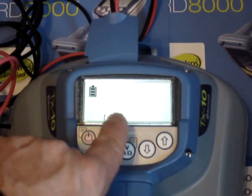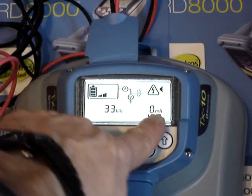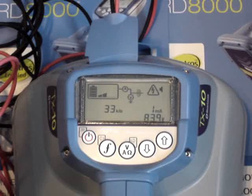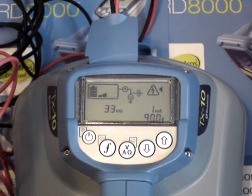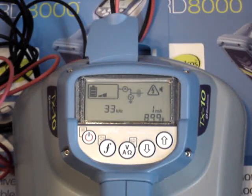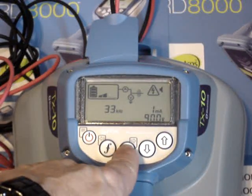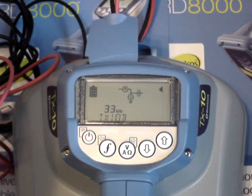Push the right arrow to go into that option and toggle it from low to high, then back out of the menu system by hitting the left arrow. You'll see a lightning bolt show up on the screen — it moves up to 30 volts, then switches and goes up to 90, eventually maxing out at 90 volts. Even though I'm not hooked on to anything, now I have one milliamp worth of current going down that line — it's actually completing a circuit by jumping the air gap between the two alligator clips because we threw out more voltage. This is unique with the radio detection unit. If you turn the unit off and turn it back on, it will always reset back to 30 volts as a safety precaution so nobody gets shocked at the end of those leads.